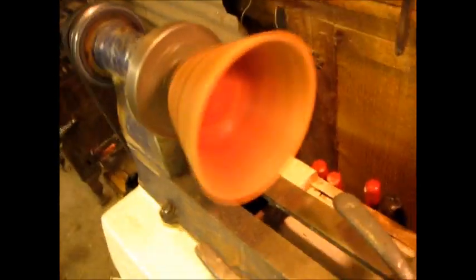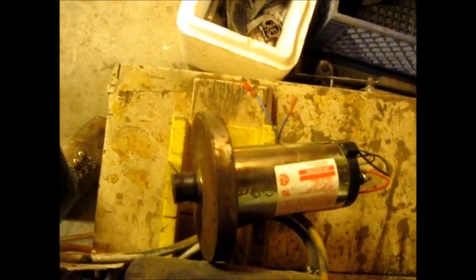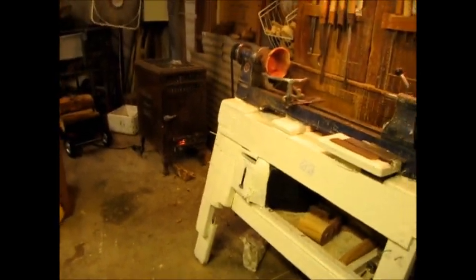There are blue wires on this type of motor for the two power wires going to the motor. Everything's there that you need to make it variable speed. Get rid of that big AC motor — take it to someone who can use it on a table saw, or use it as a boat anchor — and get yourself one of these little DC motors. They're priceless and about $300 new. It works quite well for me and I'm happy to pass it on. If you have any questions, get a hold of me through my profile and maybe I can help. Have a good day.